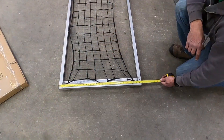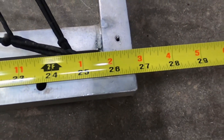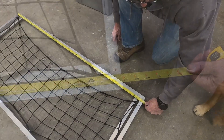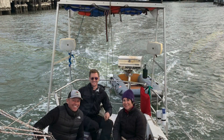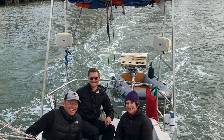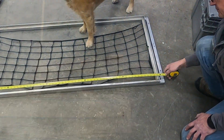Here are a couple clips showing you the outside dimensions of the solar panel support frame. Remember these are going to be adjusted based on the size of your panel. Keep in mind you can't go too narrow on your solar panel support rack because if you do the vertical supports will have to lean in too far and will most likely hit your stern pulpit. The distance between the top rails of your stern pulpit might be a minimum dimension that you can build your rack at.